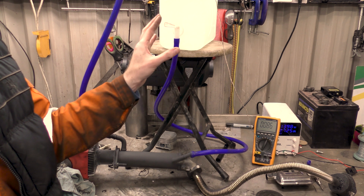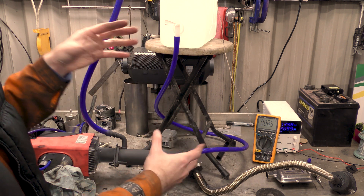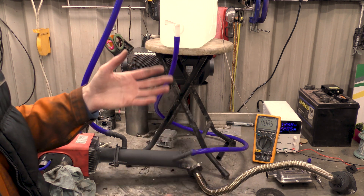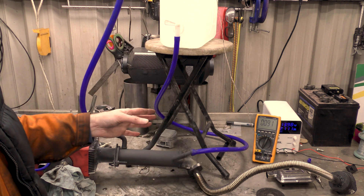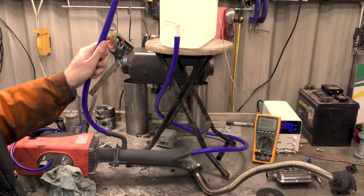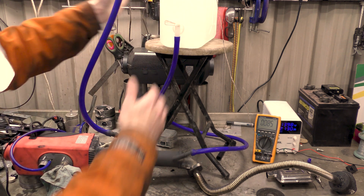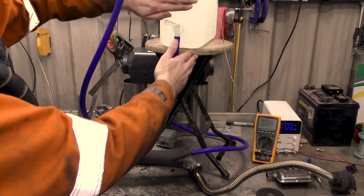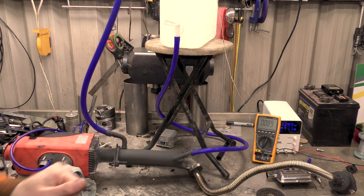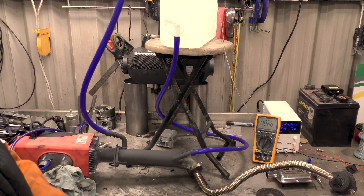Somebody asked if it would be more accurate if we left a larger volume of water running. You would take a temperature measurement as-is, then take another temperature measurement after so long, and work out how many kilowatts that was in that amount of time. It won't matter how long or how much water you leave running — it'll be different again because we've changed it into a thermosiphon and not pump-driven, so we'd have to re-measure everything again. But the fact that it's totally working, the pipe's hot, it's boiling water, and that's warmish water coming back — the jug is warm, not roasting hot yet, but it has heated some water. It would probably be better if I had the cap on so the steam wasn't escaping, but this was just a quick experiment while we're waiting for the diesel heater with the built-in water heater, and then we can try all this again and see what it does.